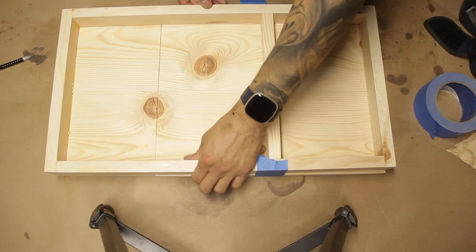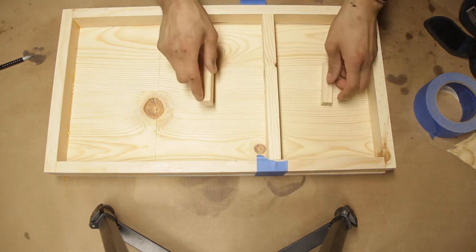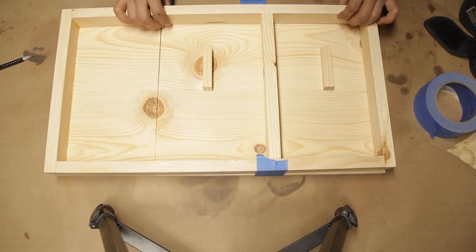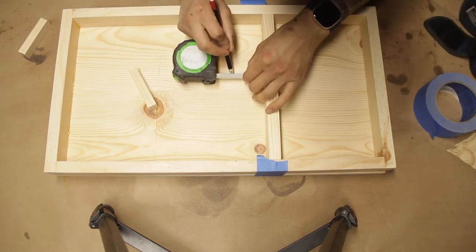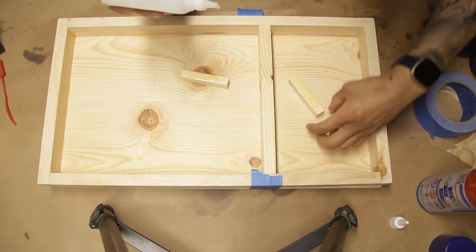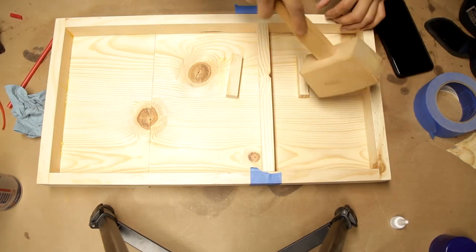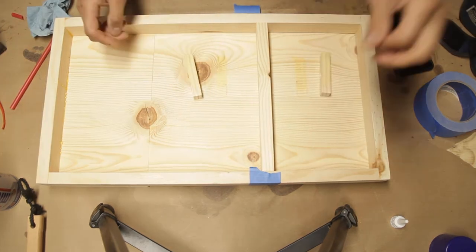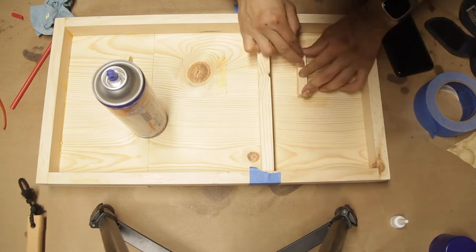Before attaching the legs, we still have some work to do. I cut these little blocks out of scrap wood — these can be any size — and this is going to be where the bar that makes the desktop adjustable will rest. I'm marking equal distances from the runner placed in the middle, and I'll use wood glue and CA glue with accelerator to hold them in place before fastening with brad nails. Silly me, I forgot to drill the holes through these that we need to fit the bar in, so I'm knocking them off and doing this over again. Just make sure to drill through the center of both blocks — I stacked them on top of each other and drilled through both at once to make sure the holes are in the same location.